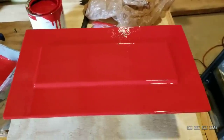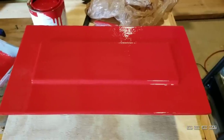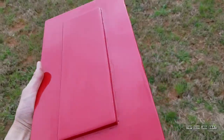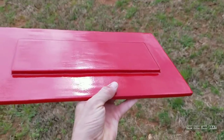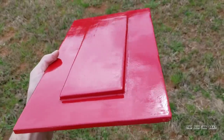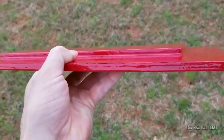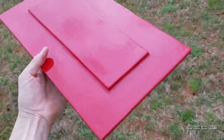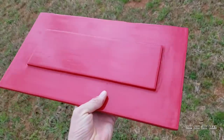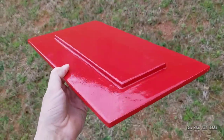Second coat is on. With a lot of things in the Top Gun Jonboat, I usually went with two coats. If I saw some sort of imperfection, a run, or if it just didn't cover well, then I would do three coats. So two coats should be fine, but we're going to see how this dries up. I brought it outside to show you how it looks in the sun — all cured, all dry, all set up. It is not tacky to the touch. Nice wet coats. Two nice wet coats should be good to go; it's got the fiberglass resin underneath it and I did all my edges. So just overkill, but two nice coats on this Rust-Oleum and man, this Sunrise Red looks good. I think it'll look sharp underneath the casting deck or on some framing. Leave a comment — let me know what you think about this color. Should I use it in my next build? I'm thinking about the next boat and the color schematics.